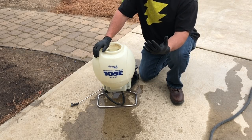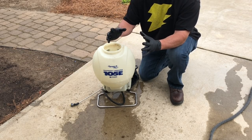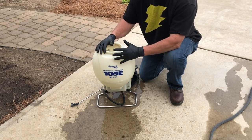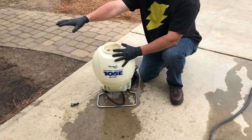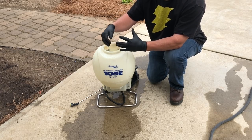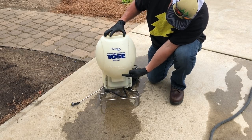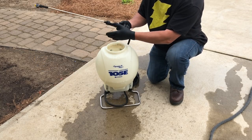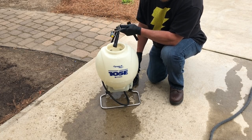I know you're saying, 'Pete, do I have to do that every time?' Well, not really. Everything I do is in a systematic approach. Let's say I'm done spraying — my RGS, pre-emergent, three-way, whatever — and I come back to the hose to clean my tank. Instead of emptying all of the water out, I always leave a little bit in the bottom, maybe a quart. Then before I put my sprayer up, I crack the hose, turn my pump back on, and just run it back in the tank.